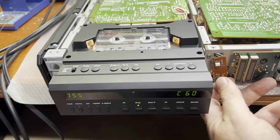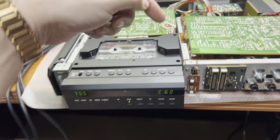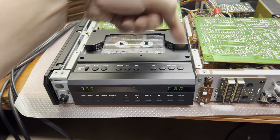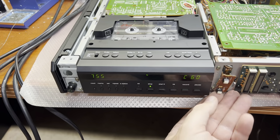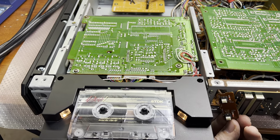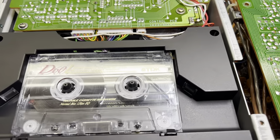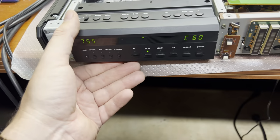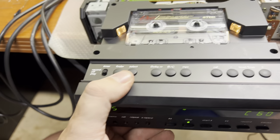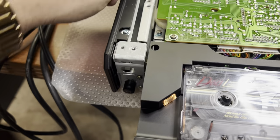Okay, we can look at the eject mechanism. It even has optical sensors for endpoints when the mechanism is out and in. I still hear the motor working a couple seconds after, so listen yourself. You see? I'm not sure, and our mechanism pulls quite easily still. This endpoint, you see here is a gear and it runs through this rail.